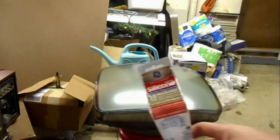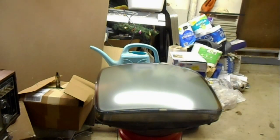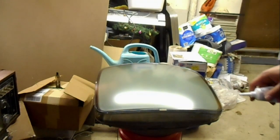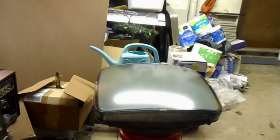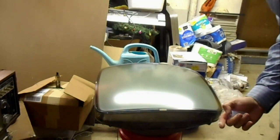I'm going to go with this GE Silicone 2 Clear. This has worked pretty good for me in the past, though I'm starting to favor black caulk because it is a similar darkness to the non-phosphored edge, and if you accidentally get a little bit of it into the screen area, if it's a smooth edge on it, you may not immediately notice it, versus transparent and colored caulks, which may make the caulk incursion noticeable. Let's just get rid of a little bit of this.